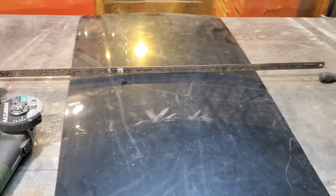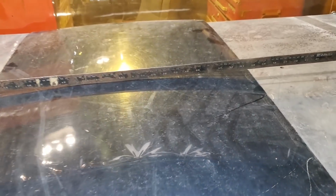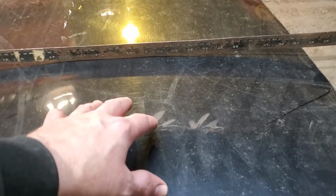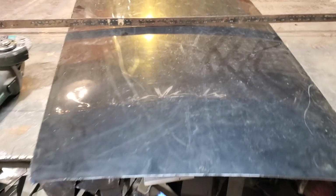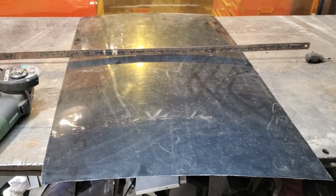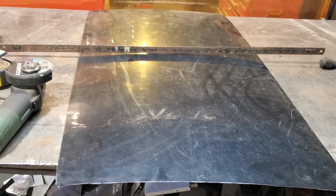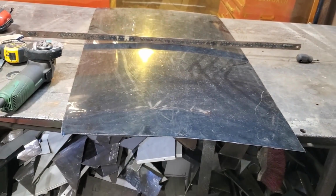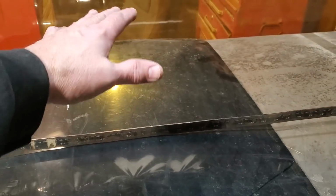Here's a closer look at what I was talking about, crown panels. See, you would think this hood is flat, okay? This is two side sections, but there is a very slight crown on that panel. This is what makes the difference between something looking right and not looking right. Having panels that look like they're made out of plywood has always been tricky. Fellas make scoops and they just don't look right, and a lot of it is because there's no crown in them, right? So this here has a slight crown on it this way, and a slight crown this way.